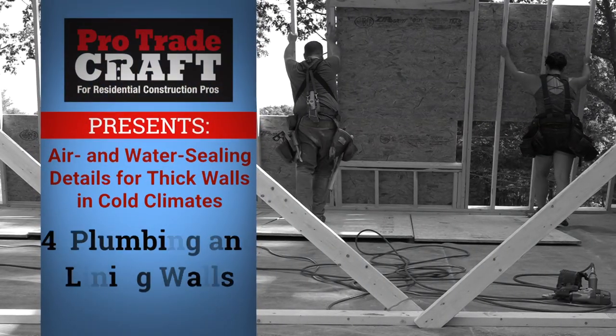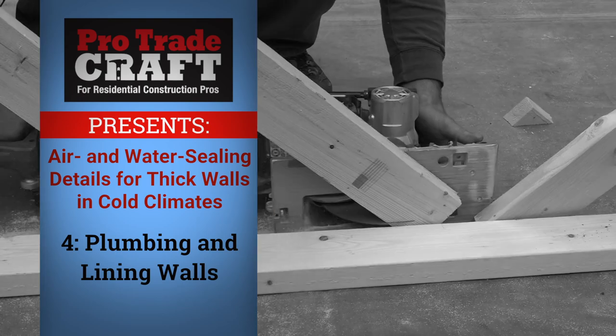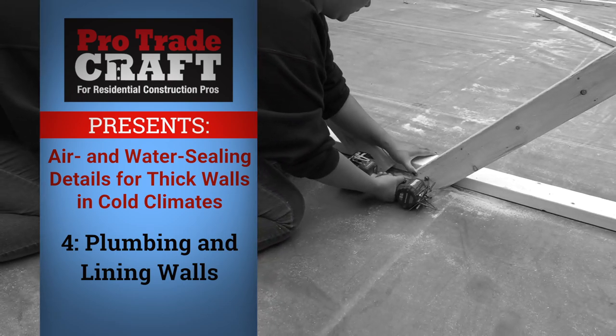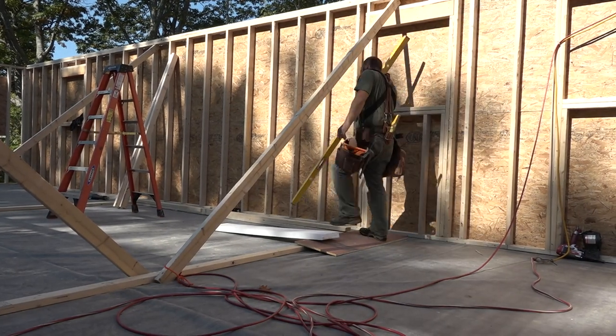Last time, we stood walls, pulled the bottoms into line, and then tightened up the tops. Just before bailing out for the day, the crew braced the walls to be roughly plumb. Today, they're going to align the tops of the walls perfectly with the bottoms.